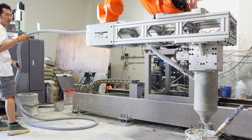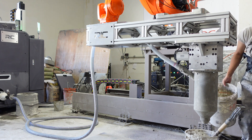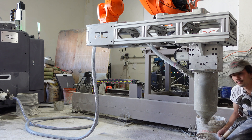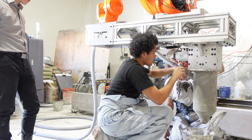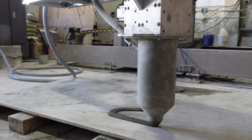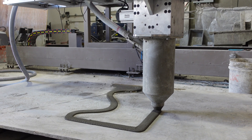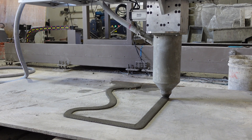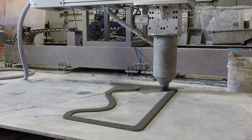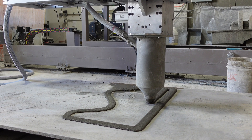Now they're going to start the print. They're running liquid through the system to make sure it's well lubricated — this helps prevent clogging. If you look closely at the hose, you can actually see the concrete going up through it because the hose is kind of transparent, which is a pretty cool feature. Concrete is very heavy so there's usually a lot of pressure in these hoses. There's a very secure connection to the extruder head, which features an auger to keep the material agitated right before it's extruded. This auger and the rotor-stator system can get aggregates stuck inside, which leads to the screeching noise you'll hear.